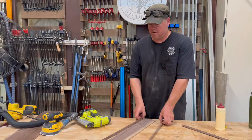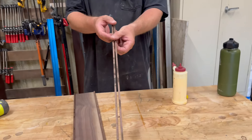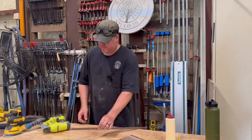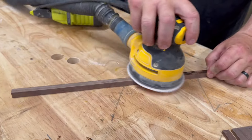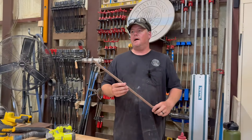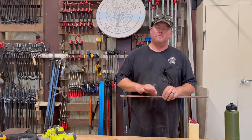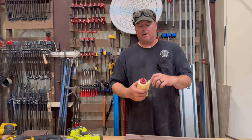I've got a little bit of burn from the table saw — I'm just going to sand that off on the pieces you'll see. Sometimes I cheat and stack identical pieces together to sand them at the same time. It probably burned because I ran a couple hundred board feet of alder through the table saw and didn't use a tar and pitch remover. Cleaning the blade makes a big difference — it just gets gunked up.